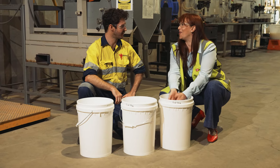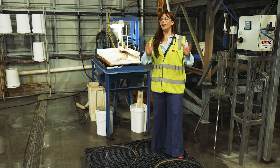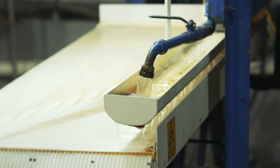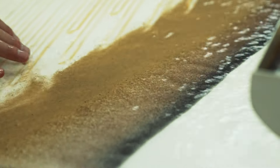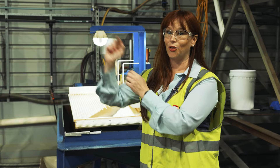So I get the waste stuff — that's right. As you can see, I didn't feel like getting my shoes wet today, but I am now standing in front of the wet gravity separation table. This is pretty cool — this is where the company starts to assess how the particles are going to work in simulation into the spiral machine. You can see behind me there are a couple of little streams coming out in different colours, and what they do is assess what the particles are going to look like when it finally runs through that beast over there.